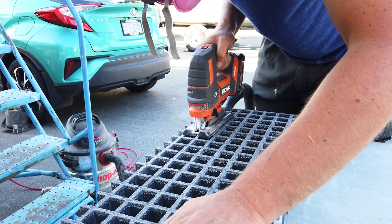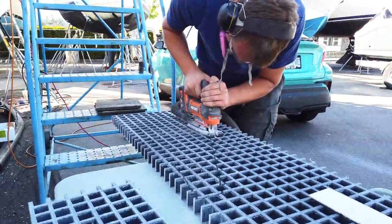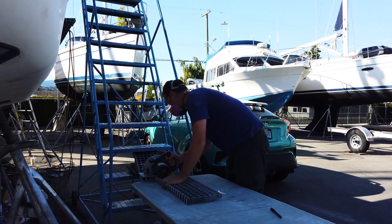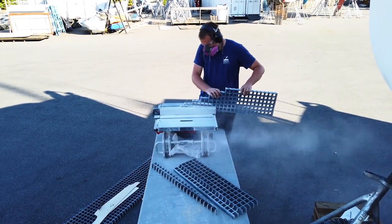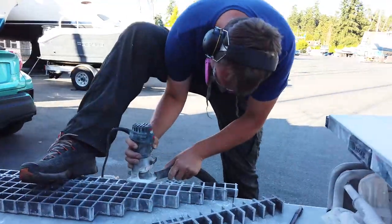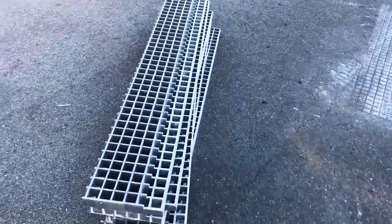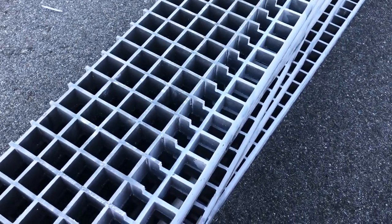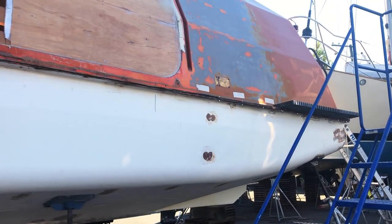Here Torin's cutting it out pretty roughly — think about if you draw a complicated shape on a piece of paper and you want to cut it out, first you'll go around with the scissors pretty wide and then come in to finish the precision cutting. Here Torin's passing the boat edge of the material through the table saw and cutting into it so that we'll have a little bit of a thinner piece at the back, which will counteract how it's tilting forward toward the water. While I've been editing video in the boat, Torin's been doing all of this heroic work — he cut them on the table saw, rounded the edges, and the next step will be to continue attaching them.